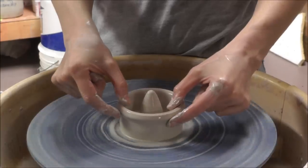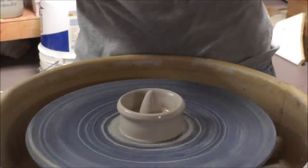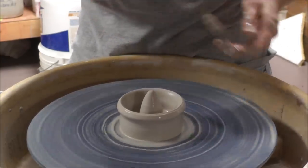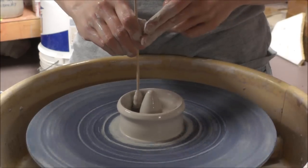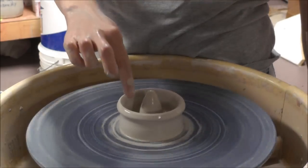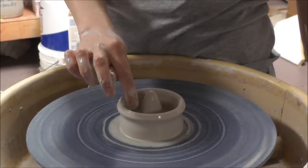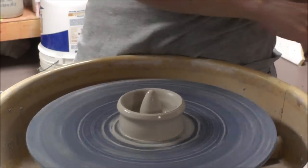Now we're going to throw this outer section up and over the top of the little cone. It needs to come up and around without touching — that's why you don't want to make the cone too tall. When this thing is filled with salt or pepper, it'll sit down in the trough, and you'll put a hole right at the top of the inner cone from the outside later on. When you shake it up and down, the salt in the trough will come up, hit that hole, and come out onto your food.